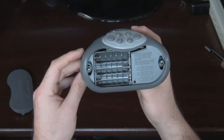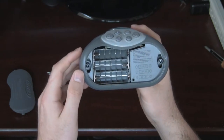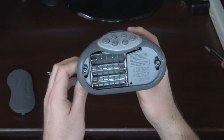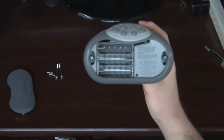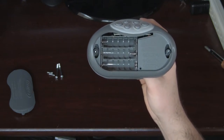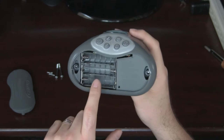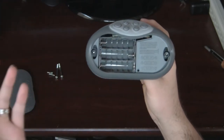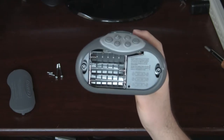A fresh AA battery is about 1.6 volts, and if you add that up that's about 4.8 volts, which is really close to the 5-volt typical output of a USB plug. So what I wanted to do was get rid of the three AA batteries — of course you could use rechargeables, but then you're still using batteries — and plug this into a wall source.